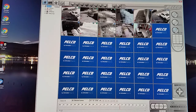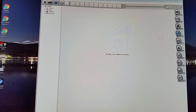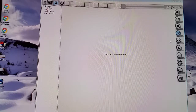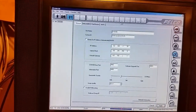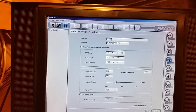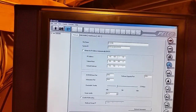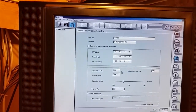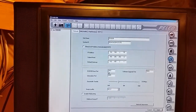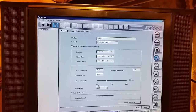I will show you my workaround for that in a bit. On the DVR itself, go to Settings, then Network. Here you can give it whatever name you like — just call it DVR. Make sure it's not on automatic; assign it a static IP. Pick one that's free on your network, leave the subnet mask at 255. Leave the ports at their defaults: 9002 for the remote client. The other ports are for things like updates. That's really all you need to do in the DVR — save that, then go into user accounts and create your user accounts.